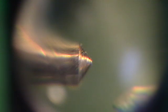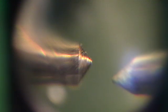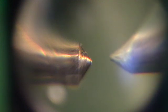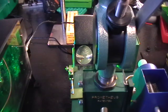Powder's been dumped in the hopper. It's been thrown low. Again, we're going to trickle up. And here it comes. That threw slightly high. Within tolerances though, if I wanted to, once I dump the powder into my brass, I could roll a single piece out if I wanted to. But where those needles are right now, I would accept that and not worry about it. So that is how the Gen 1 basically operates.